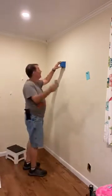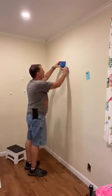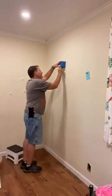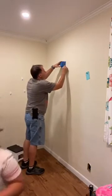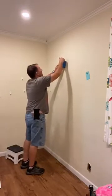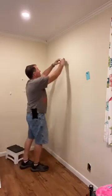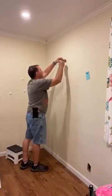You've got your level — put your level on the bottom. Make sure the box is level so when you trace it out, you'll have a nice level opening once you get it clapped out. I'm going to use those little spots with a pen. On the outside you can mark it with a pen, but on the top and bottom you don't want to cut to the outside because the box will just fall in the wall. I can take my level again and connect those lines for a nice clean cut.